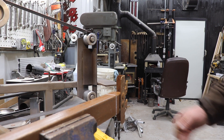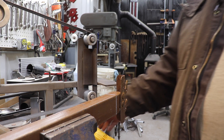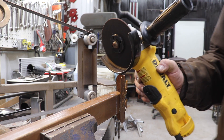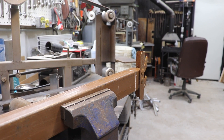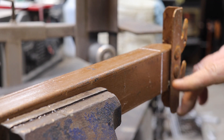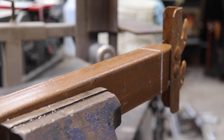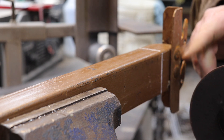A good thing for you to do right now is to put on a pair of safety glasses and a pair of leather gloves, because if this thing kicks out, it could nick your finger. I've seen so many people take the guards off and all it does is let it burn your hands — sparks fly more and then you have a better chance of getting your finger caught on that wheel. We have our mark where we want to cut. When I start cutting, I start at the bottom and all I'm going to do is kind of score that cut in there so it stays. We're going to put our grinder right there at the bottom and go ahead and start cutting — just score that line first.